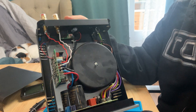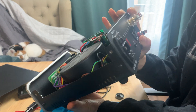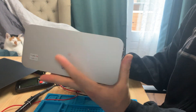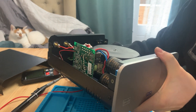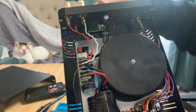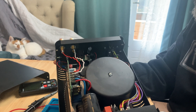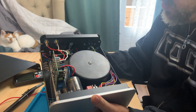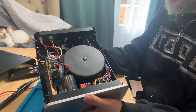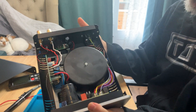One of the problems I had with these when I got them is that the only way to turn them on was through a remote on/off 12-volt trigger, which is nice, but this switch up here doesn't work. So I took them apart and found a little jumper inside, and discovered that if you switch that jumper, they start turning on even without the 12-volt trigger.